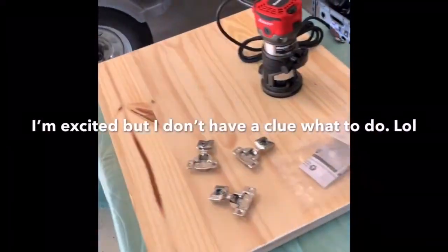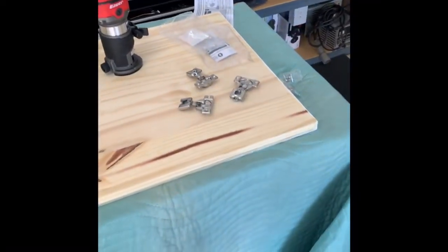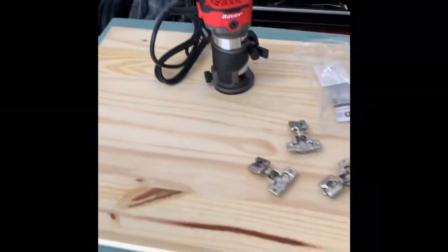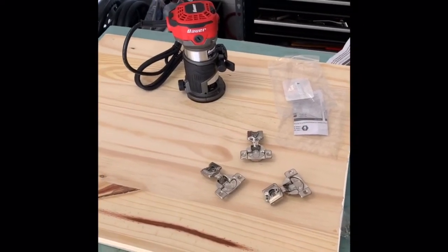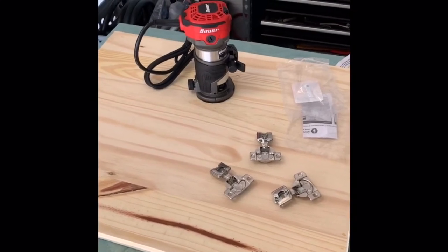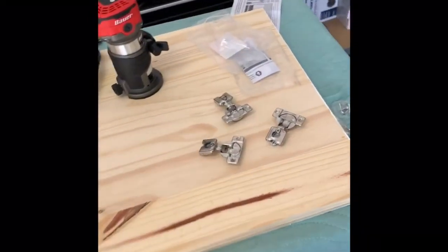As far as the paint on the wood, it's a very good idea to prime it. I didn't prime it, so I bought some paint that was all in one primer, and I've had to put on maybe two coats, and I might even go a third coat, because that white will gray out. Obviously, that wood is bone dry. It's just gonna suck all of that paint in, which is fine. So I'll just keep putting as many coats as needed for it to look amazing when it's done. Stay tuned.